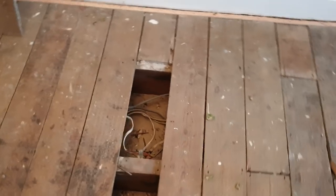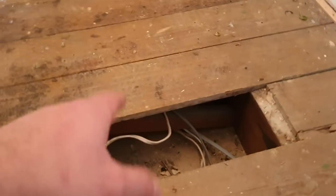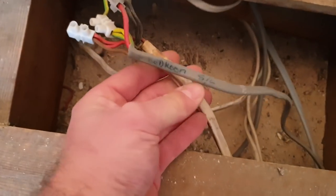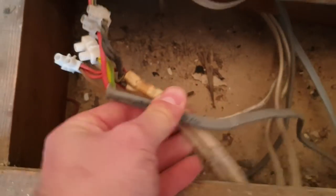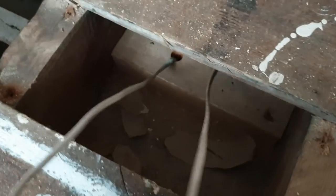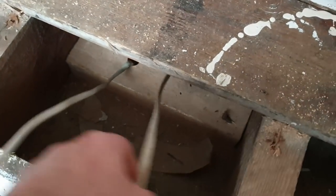Alright, I'll tell you what your job's going to be. We're going to go downstairs, we're going to hang down the pendants, and we're going to bring these three plate cables out properly. Does that make sense? So, the original cables, these ones on this side, someone's actually labelled it. The ones on this side are actually going to come out the light. Alright, so we've only got one wire at the next one, but it could be a loop feed. There's no lamp in it before, so we didn't actually test how it was switched.